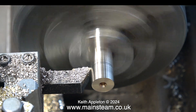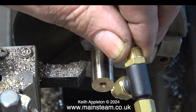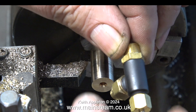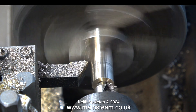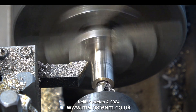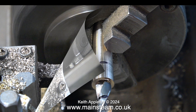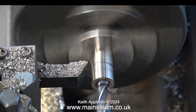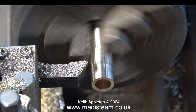This is not a good practice at all because it's not going to be 100% true, but trying to keep it real — this is only a water pipe fitting, not a part from a steam turbine, rocket, or satellite. After center drilling, I use a twist drill to enlarge the hole — a twist drill which is tapping size for 3/8 by 32 threads per inch. As a general rule I always use two imperial drill sizes down as tapping size drills for ME type threads.